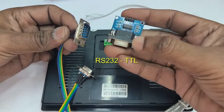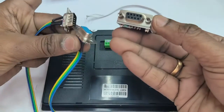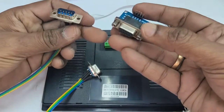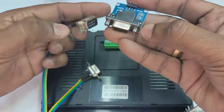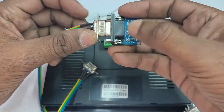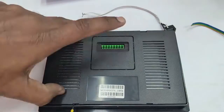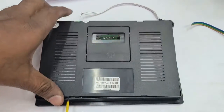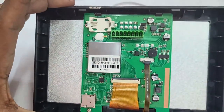If you want to connect a microcontroller, you need an RS232 male connector at the DWIN side and an RS232-to-TTL board like this to connect with Arduino or STM32. Both methods will be tested today. This RS232-to-TTL board is made of a MAX3232 IC — a very effective IC that works on 3.3V as well as 5V.